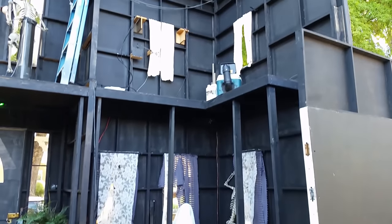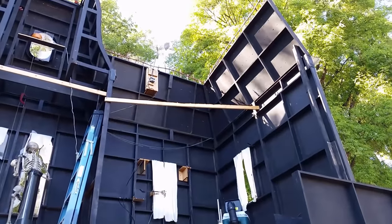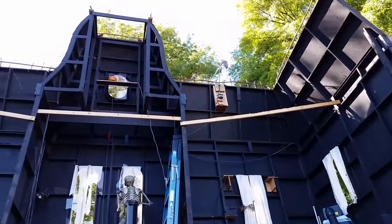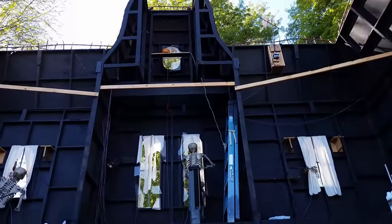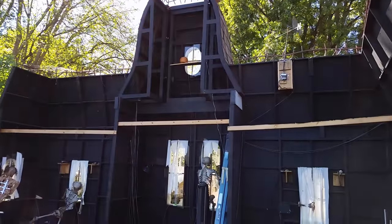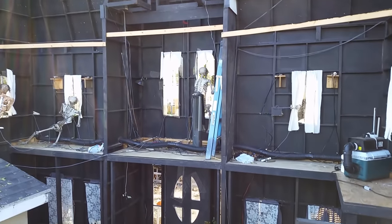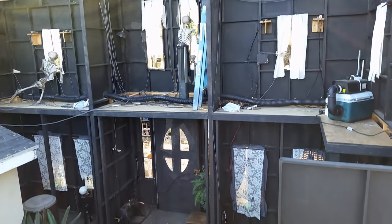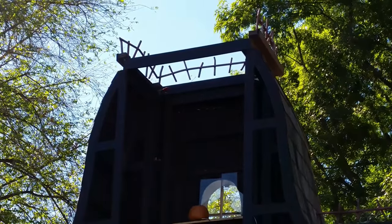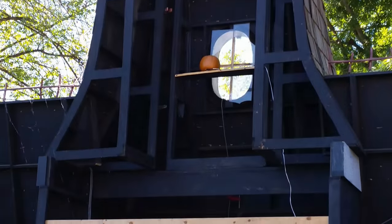Now that we've removed all the drops, you can see the second level pretty well — it definitely looks like a big dollhouse with a bunch of creepy dudes hanging out the windows. All the walls and angled roof panels are framed with one-by-three pine and skinned with a quarter-inch Luan glued and shot together with staples. We used three-quarter plywood to frame the center curved bell-shaped roof and then skinned that with a quarter-inch bender board.